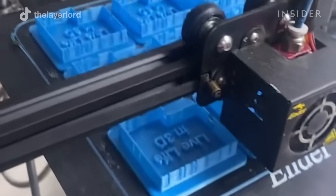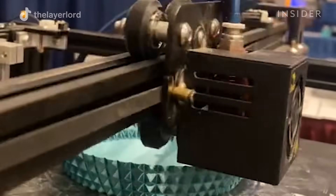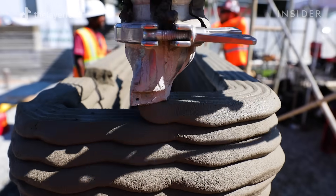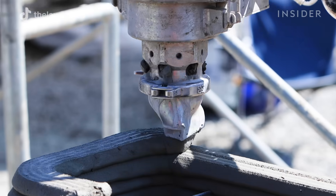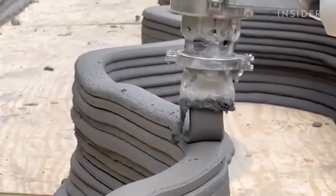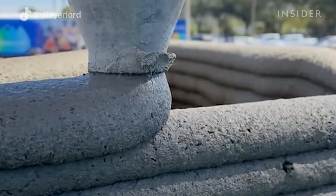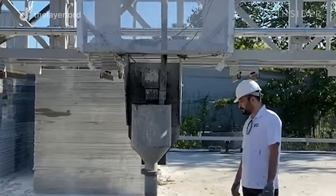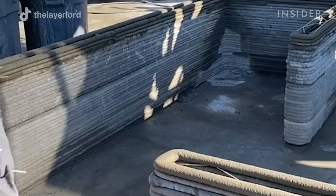This process isn't very different from a typical desktop 3D printer. You start at the design stage and create a CAD file that basically tells the machine where to go, how fast to do it, and how much material to let out at that specific spot. The program defines the center line of where the nozzle is, and the printer follows that line throughout the whole process. The way the printer reads it, it's a cross-section — as if you drew the object and cut out a very thin slice. The machine sees a series of those cross-sections over and over to complete the house.